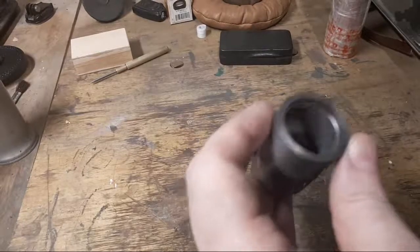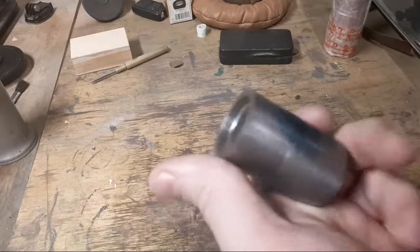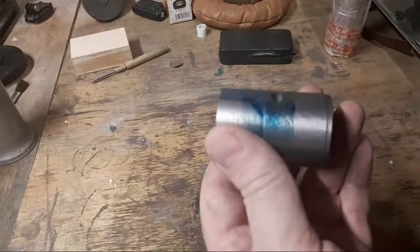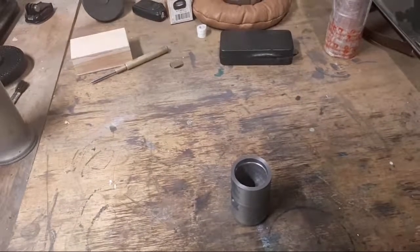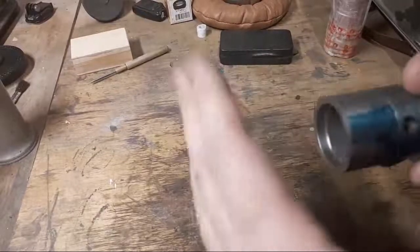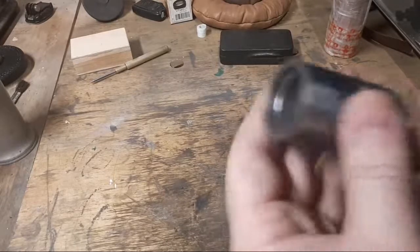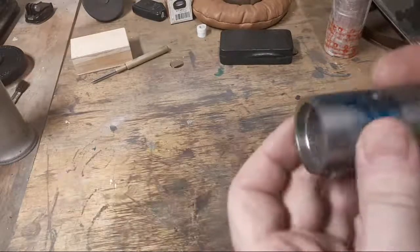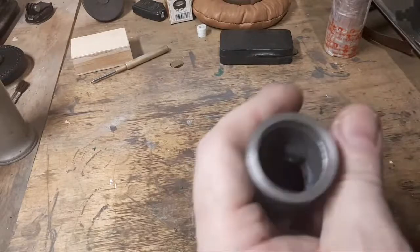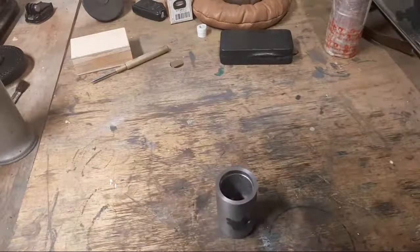Super glue I don't think is heavy enough. I think it's going to require a bit more effort than that. So I might make a proper bolt to hold it down, because I'm reluctant to rely on this, and you don't need much run out on the end before it won't work. So that's the way I'm going to do it. In the lathe I'll set a boss up in the 3-jaw chuck, a piece of steel, machine it, and I'll use an eye bolt in the center with the gudgeon pin through it to screw it on, and then I'll be able to machine the outside and the rings and everything. So still needs a little bit more off it.